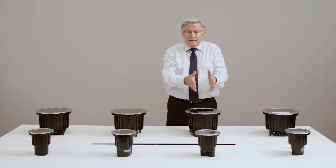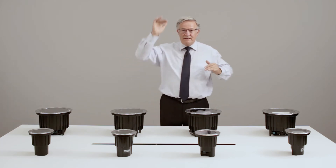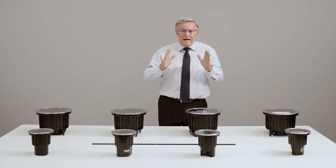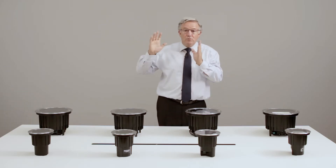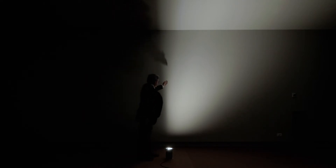Now we see the mini — always try to use two wall washers when making tests. Whether ceiling or floor mounted, we have the same low start of the beam, a fine bottom shadow, quite high illumination, a wide beam, good distribution, and good spacing. As for the quantity of light, we have over 65 average lux on the wall. And look at the wall — it has very good glare control thanks to an excellent cutoff.